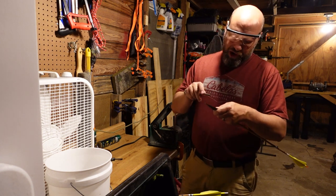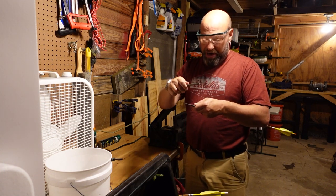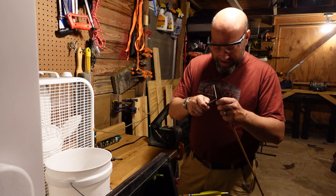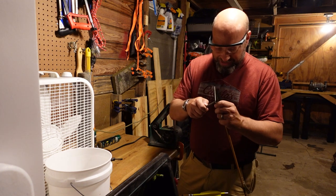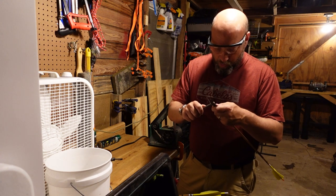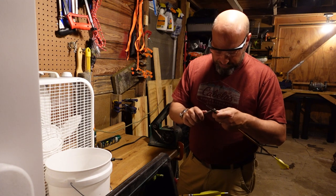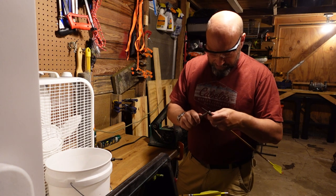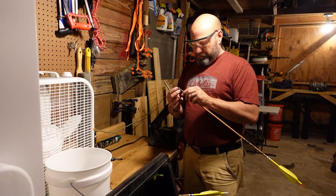Because anytime you're sharpening from the ferrule out to the edge, you're going to create a burr on the edge. So by doing this, I'm going into the ferrule from the blade, okay, from the blade into it. That's knocking that wire edge off of there and making sure that we are down to a good solid edge. That wire edge is a burr. The burr that's formed creates the wire edge. And this just makes sure it's not there. Okay, so there we go. Perfect, good.